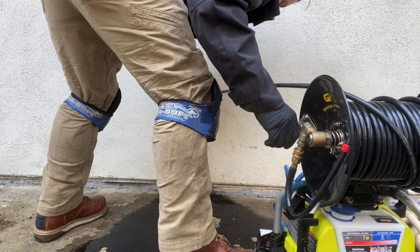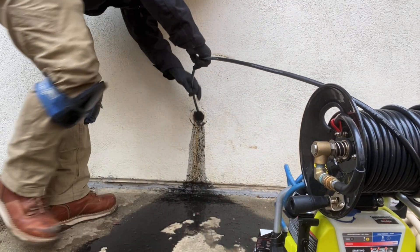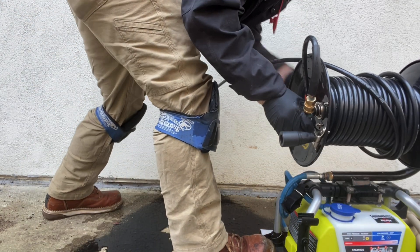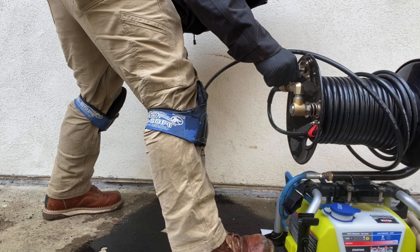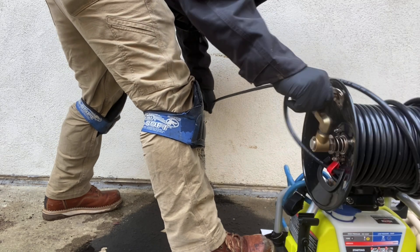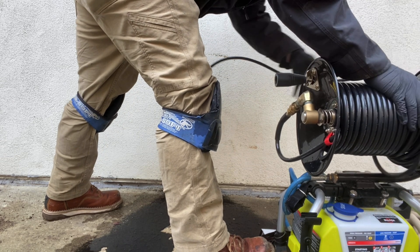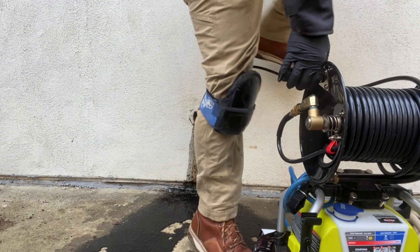The nozzle I used had three jets going backwards and one spinning jet going forwards, and I figured that would be the best to really cut those wipes off the tip of the flex shaft. Thankfully I was right — it took all of maybe 10 minutes for this pressure washer converted into a little jetter to cut the wipes off the tip of that flex shaft. It was really cool, I was super stoked. I didn't have to break the stucco and possibly even jackhammer to cut the drain out and retrieve the cable for the customer.